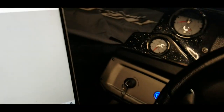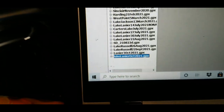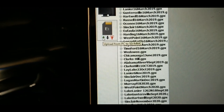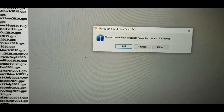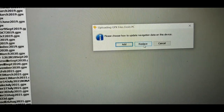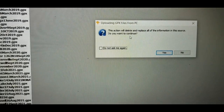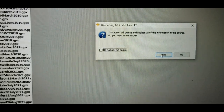From here, take the SD card out of the unit, put it back in the computer, and transfer this file — which now has all of the waypoints — to that SD card. Go to the green button that says 'Upload from PC to SD' and click that. It will ask how to update navigation data on the device. I am going to replace everything on that card so it doesn't put the waypoints on there twice. Click 'Replace Everything' and then confirm yes.